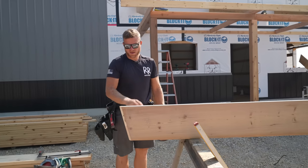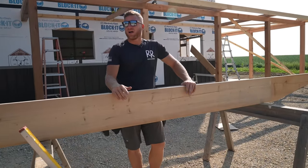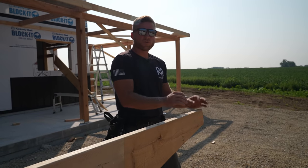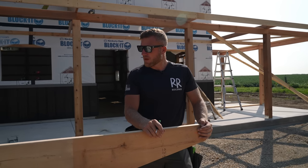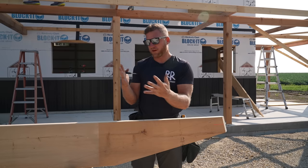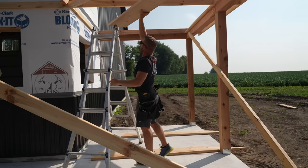If math doesn't lie, that sucker's going to fit right in there. But one more thing I want to do is lay out where my purlins are going to die in here — I swear I always get that wrong. Things like not adding up little tiny measurement drops — even though they're very small, like 3/16ths of an inch here or there, they add up and I need to calculate those. All my purlins are coming in at an angle — I can't just go every two foot. It's based on some compound angles of this rafter at a different angle than a 4/12. My execution is flawless.